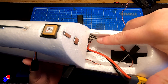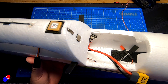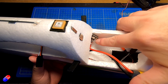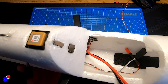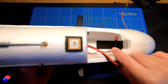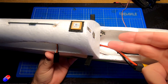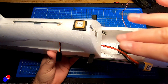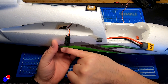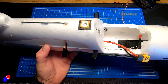The last thing inside is an external board on the side, again held in place with 3M VHB tape. This has the buzzer and connections and is nicely out of the way. The battery sits up front near the nose — there's loads of room in there — and the flight controller assembly sits more or less underneath where the centre of gravity is, which helps keep all the CG correct.